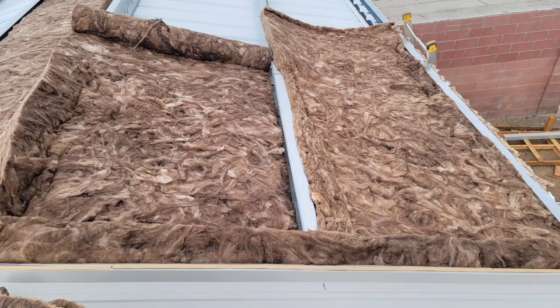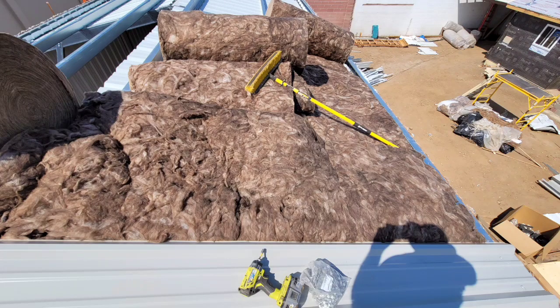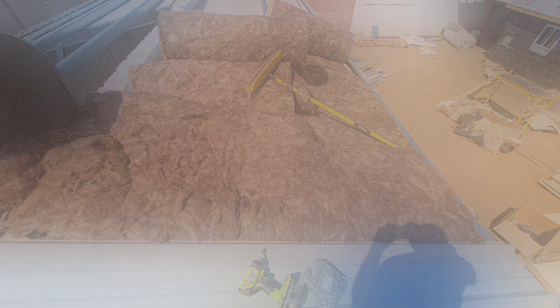This is a four-inch purlin roof assembly, and they ordered or were told that they were getting R30 insulation. R30 requires almost 10 inches of space — so how are you going to do that in four inches? You've really got to make sure you know what you're getting, including all the dimensions. If you're doing something custom, like a bunch of windows or transverse walls inside or even liner panel — like this one has liner panel — make sure you understand clearly on the drawings what you're getting. Because one of the things they do is before they release these buildings for fab, they make you sign a piece of paper that says everything's correct and that's the way you want it. So if you're not well-versed in this, you've just taken all responsibility for how it was designed, and it may not be what you wanted because you didn't quite understand it.